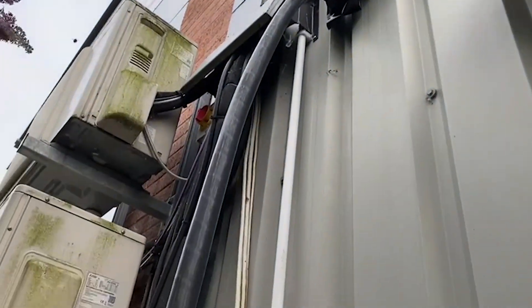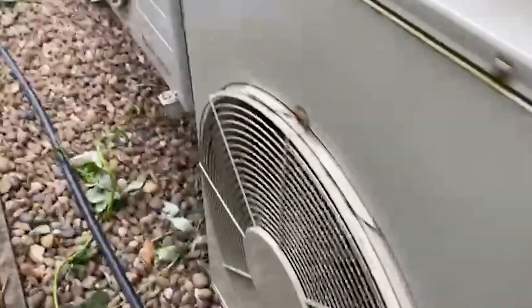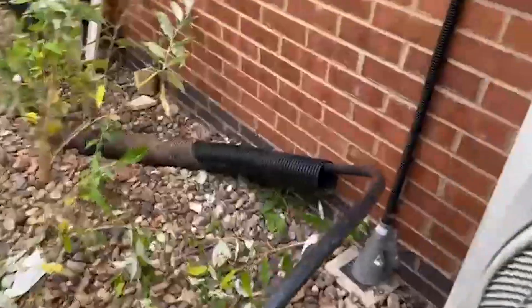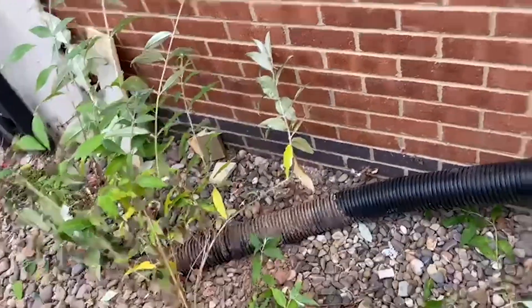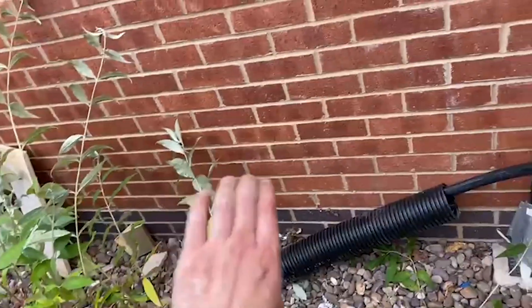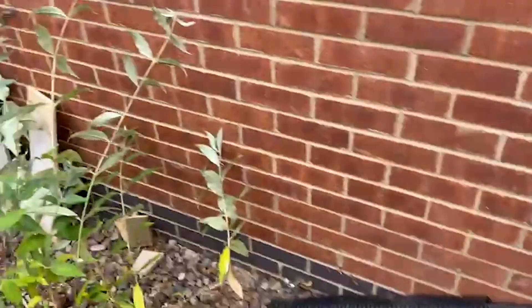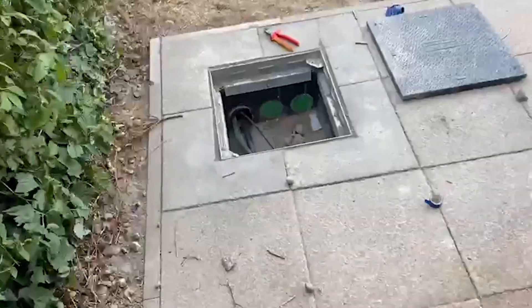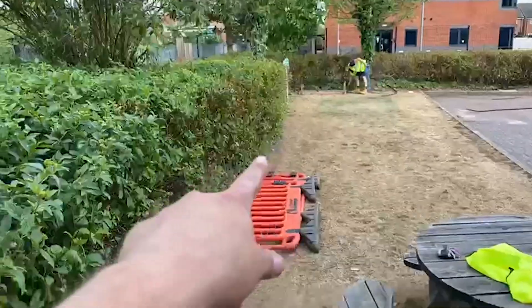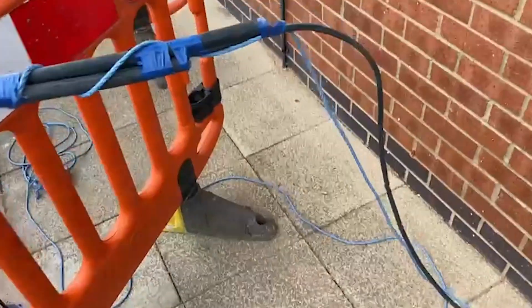It's been an absolutely boiling day. We've got the cable through — I'll show you. Cable comes out there; I'll put a bag over it to stop water getting in. There'll be cable tray across the bottom. I'll push that back to the wall, tie it back. It ducks under and then jumps onto some tray work all the way along, going through to the duct — the big fat cable going this way and two EV charger feeds the other way.